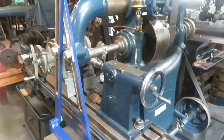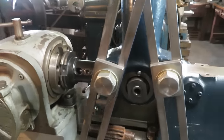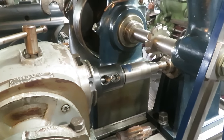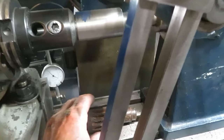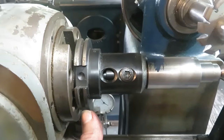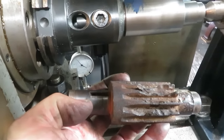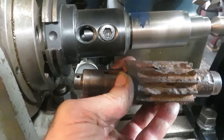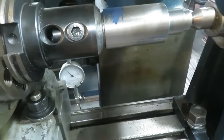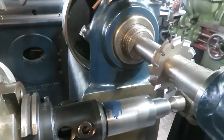Okay, I'm getting ready to cut this gear on the 1895 Brown and Sharp mill. Tom and I worked on this setup and didn't have much time to take video of it, so I'll show it to you now before we get started. This is the old part, and because I don't have a chuck for this dividing head, this is actually a large end mill holder. It's 1 inch, so this part of my blank is actually 1 inch. In order to cut the teeth the right direction and have them end up on the left side, I had to mill from right to left instead of left to right like I usually do, which meant that I had to run the milling machine in the reverse direction, which has no reverse.